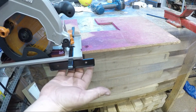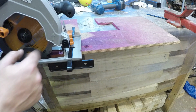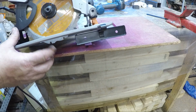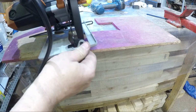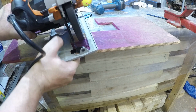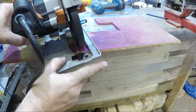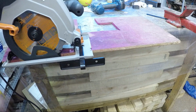Right, so what I've done is I've set the fence to 1 inch from the fence or guide to the carbide tip, but I've raised the cutting depth, so we're only going just through the plywood. The reason I've done this is because earlier I mentioned this movement we've got in the back here, and I want to see if that affects the blade in any way. I'm forcing that now and it is moving. You can see that on screen. But that's not saying it's not going to cut perfectly. Okay, right, let's go for it. Plug it in again.